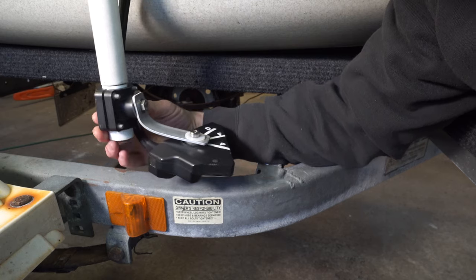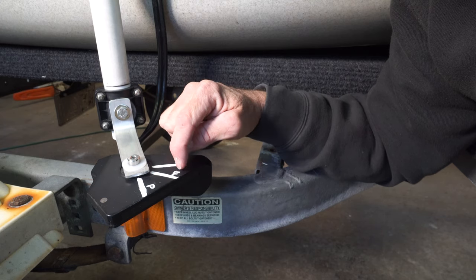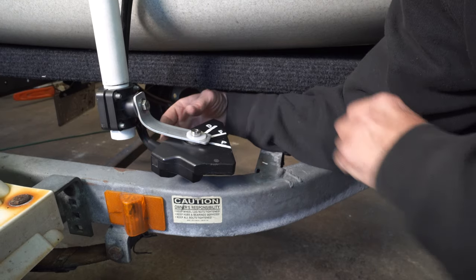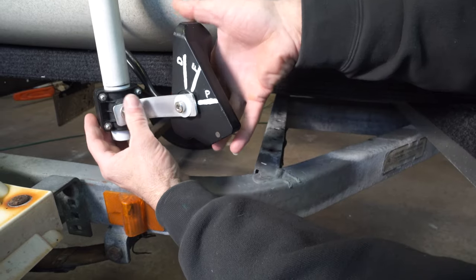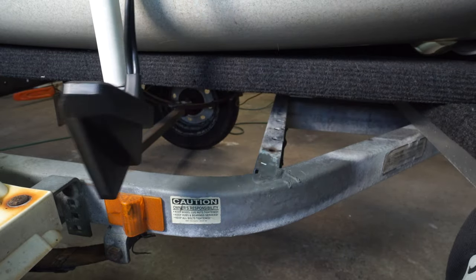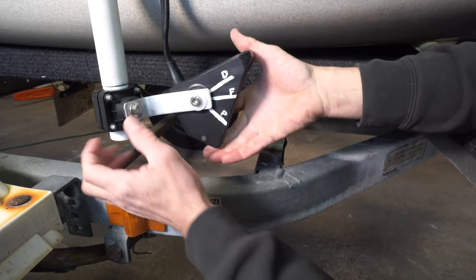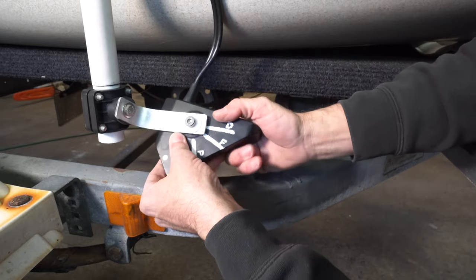Here it is mounted on my rotating assembly. I've already painted some indexing marks on here that identify the position for down scan, forward scan, and perspective scan — pretty much just line it up with the center of the bar. Right now it's horizontal, basically looking towards the front of the kayak. To change modes, I just pull this up, rotate it into position, line it up with the F mark, and I'm in forward scan mode. I can look all around behind me, underneath me. Rotate it the other way and I'm in down scan mode.